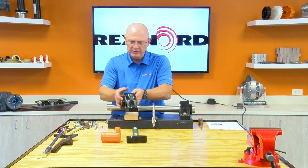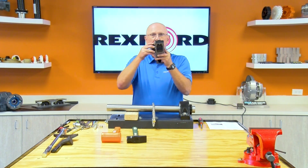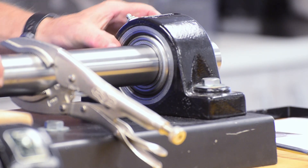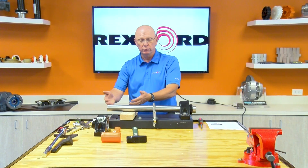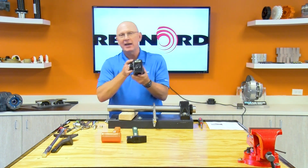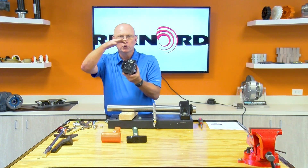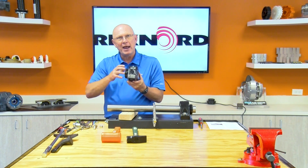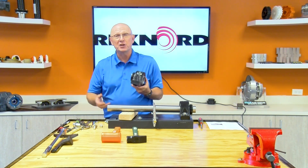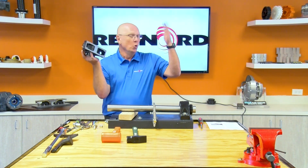When using a tapered adapter, one of the things I like to promote to make installation a little bit easier is to use a fixed unit — meaning no axial displacement — and an expansion unit. You can see this unit slides back and forth along the shaft, allowing for thermal growth or any axial movement. When you tighten a tapered adapter, it wants to pull the whole bearing assembly toward you. So if I torque down the bolts on both units and then tighten the tapered adapter, it's going to thrust-load one bearing against the other — that is not a good thing. You may think it's tight and it's not, it could spin on the shaft, and could damage the bearing due to thrust. I recommend fixed and expansion when using the 6000 series or any tapered adapter, regardless of make or model.